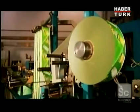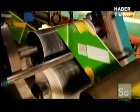The paper layers then twist around a mandrel that's turned by a big belt. The belt also presses the glued layers together. Next, the label paper gets a coat of glue, which helps it stick to the paper on the mandrel.